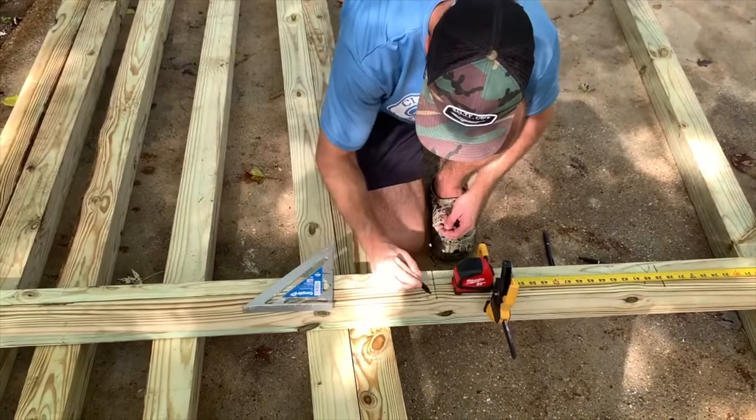At this point, we're going to set the initial spring tension for the door, and to do this, we're going to give the door barrel 2 full revolutions towards the door opening. In other words, you're going to rotate the door as if you were sending the curtain down through the guides. After giving it 2 full revolutions, you're going to remove the plastic wrap around the door, and we can begin to move the curtain down into the guides.